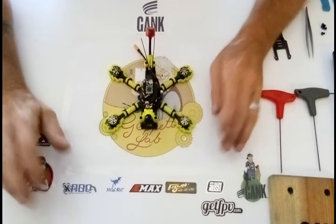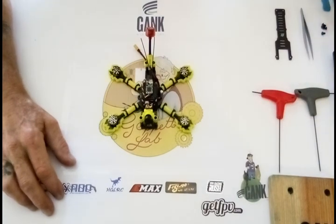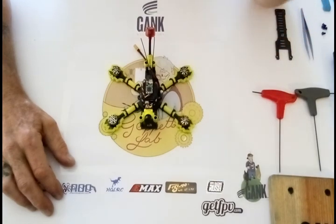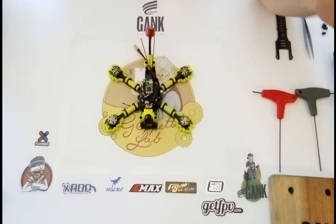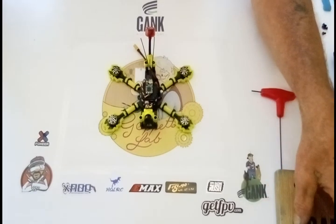So I went through the OSD using the stick method, you know, throttle up halfway and to the left, pitch forward, went in there, down through my OSD menu, through Smart Audio, and set it up just as I did in Betaflight. Fat Shark, channel 5, 500 milliwatt, and I turned pit mode off. I fly alone. I don't need this low to no video, no noise, nothing like that. If I wanted to go to 800, plugging it in, that's what I can do.